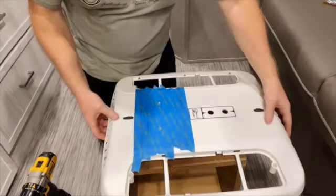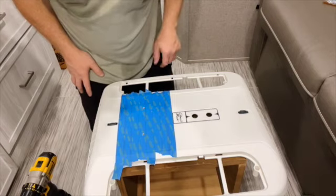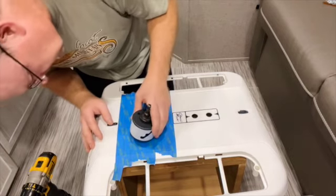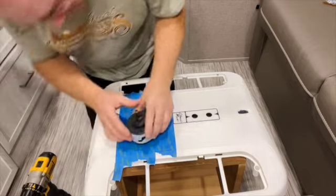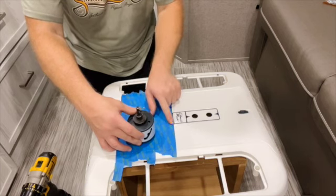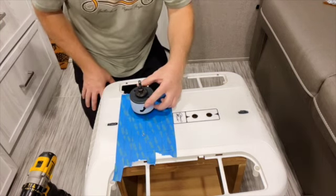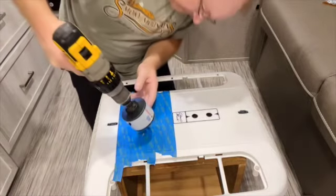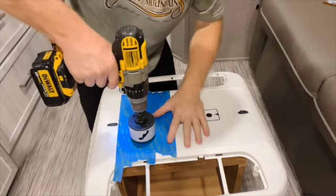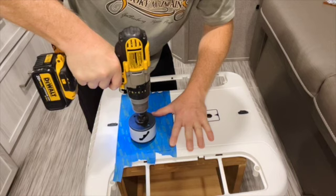I've got a wooden crate from the garage to work on. I've drilled the pilot holes from the backside and put tape on the front. Turning it over, you can see where the holes are. Setting the hole saw in the pilot hole, you can see it will have clearance around the edges and is centered between the flanged area. Now I just need to drill that hole — I'm going to try to hold it securely and hopefully nothing breaks.